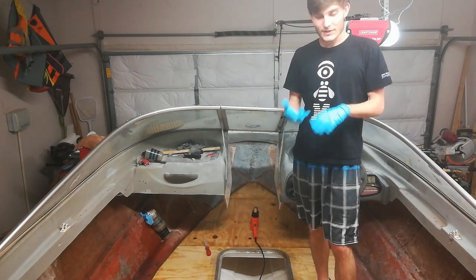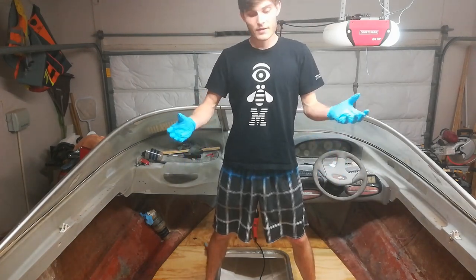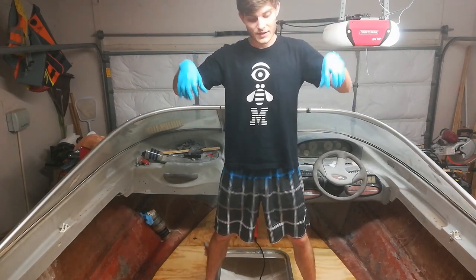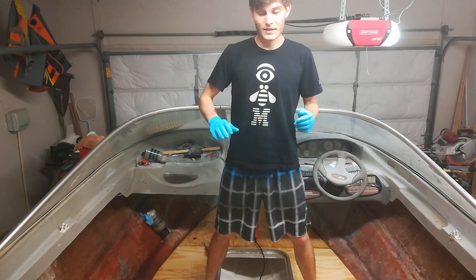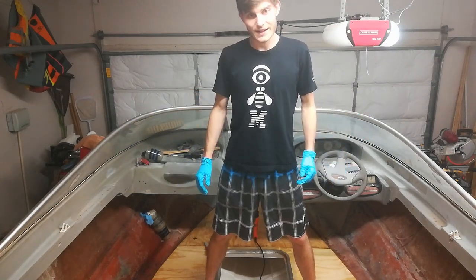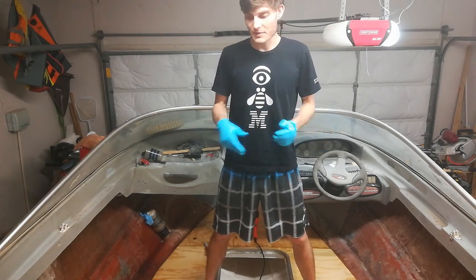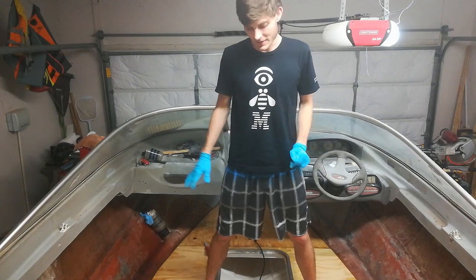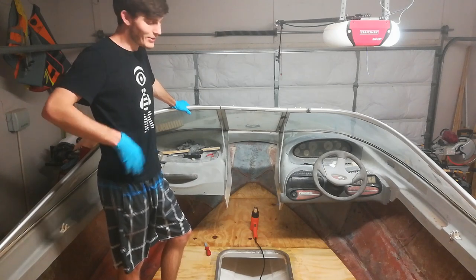And that's going to do 3 things for us. It's going to make the boat more soundproof. It's going to help give the deck a sturdier feeling because that foam will be pushing up against it. It won't just be a void where the deck could fall into. And also, because the foam will be filling the space, whenever it warms up and cools down, the air underneath those voids in the deck won't be able to have the moisture condensate, which could eventually lead to water damage in the deck. Even though I waterproofed it, mostly, the foam will just really help prevent that from ever happening. So, let's go ahead and get the drill out and start drilling some holes.